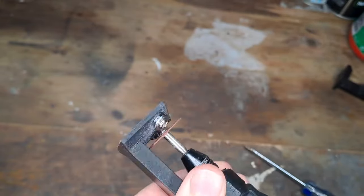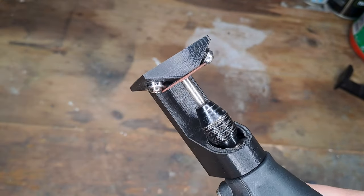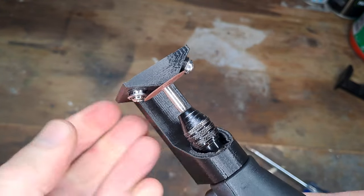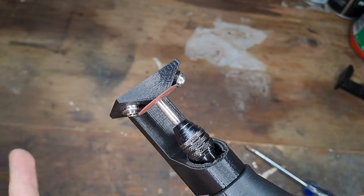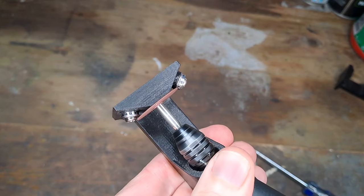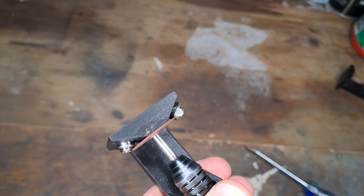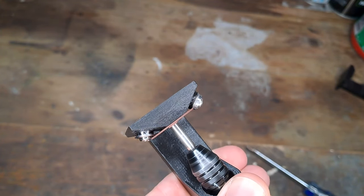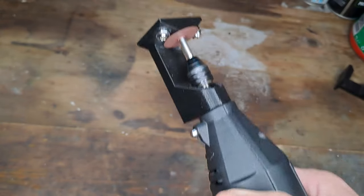Once the bearings are installed, rotate the jig on the cutting tool until the disc is almost touching the flanges, then switch the tool on and very slowly advance the cutting disc by rotating the jig. You're looking for the bearing rotating and generating sparks — one bearing may grind before the other. Watch for the unwanted dynamic where one bearing rotates and the other doesn't, which causes a flat spot. If you can get both rotating simultaneously that's ideal; if not, take one bearing off and do them one at a time.